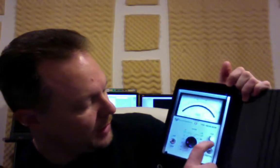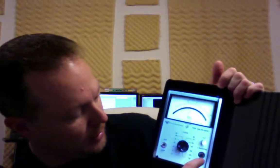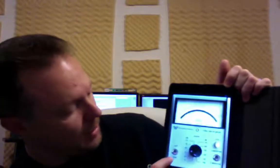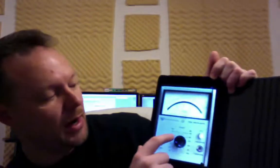Here's the one I have on my tablet. You want to make sure that you have the ability to select C-weighted — here you can see it's A-weighted, but you'll be able to select C-weighted. You also want to have it set to slow time, not fast. Make sure you're able to calibrate at slow speed. I'm going to be calibrating at 80 dB as my threshold today.